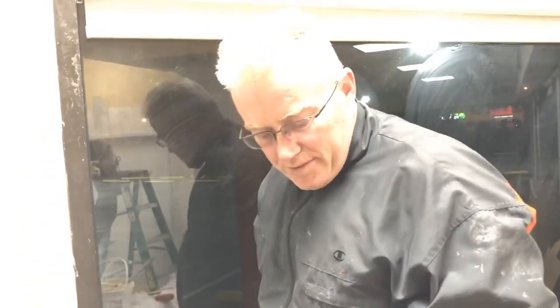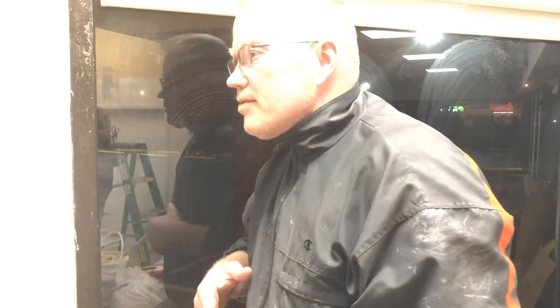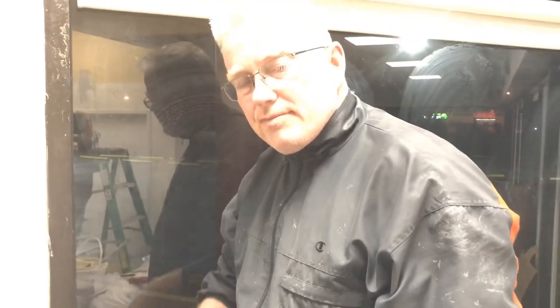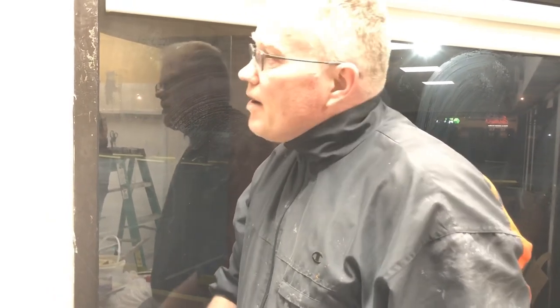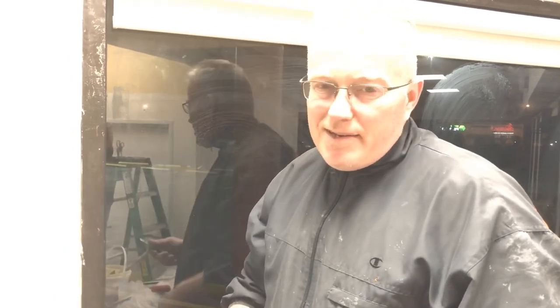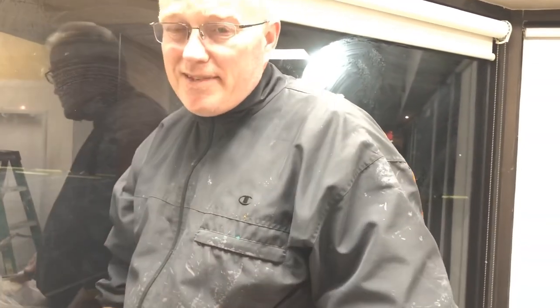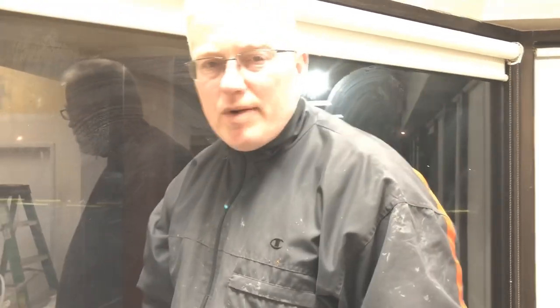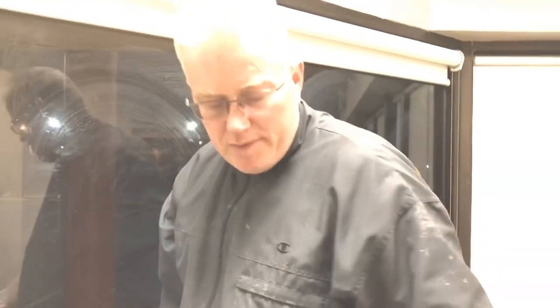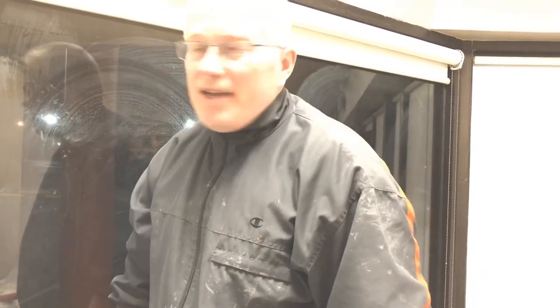If you cut your paper according to some of these irregular angles, it'll look pretty bad, okay? So we do things in right angles in wall covering. You don't start cutting according to the angles that are made on these walls and ceilings and stuff, because a lot of times people don't take the time to do it right, okay? So we have to adjust to the less than professional standards, and certainly always less than perfect standards, right? Nobody's perfect, but sometimes they're not even extremely professional. And this is one such case.